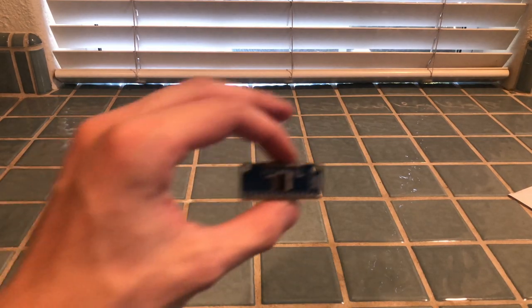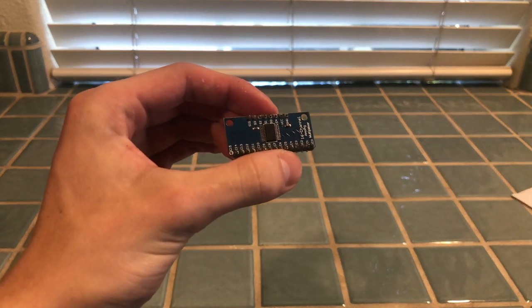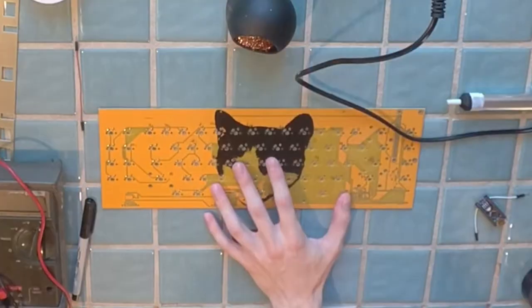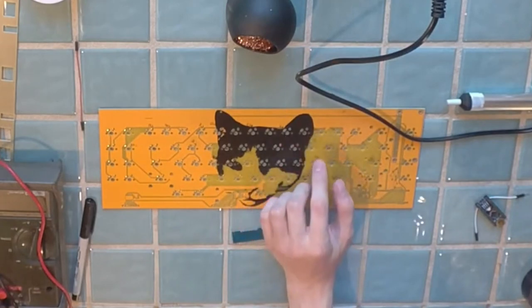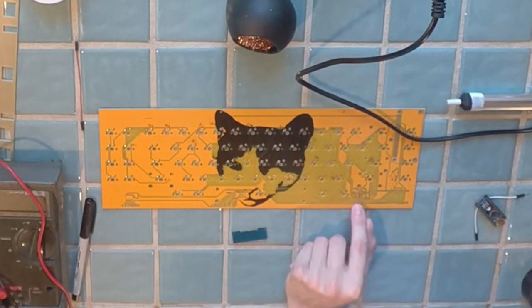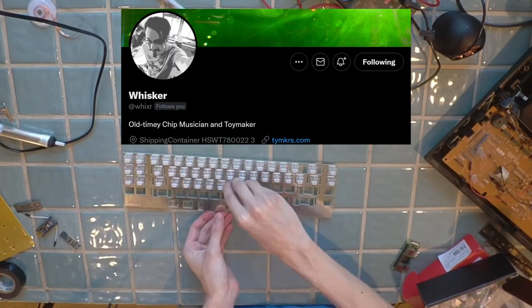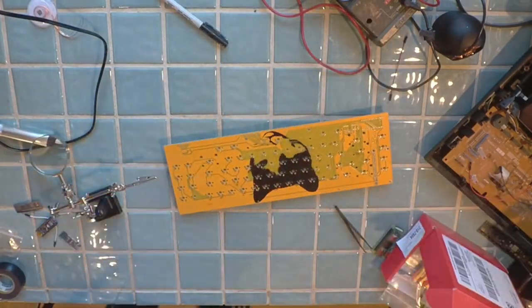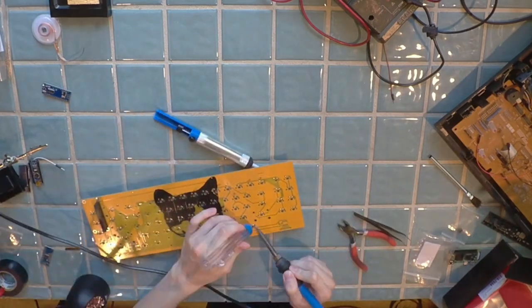Since I didn't think I'd be able to desolder it without breaking it, I decided to start over and wire up the multiplexers from my prototype to a new PCB. I labeled a pin from each of the keyboard matrix's rows and columns so I could solder wires from each of them to the multiplexer's channels to scan the keyboard. One of my viewers, Whisker, sent me these Matthias Alps switches — they're super clicky and should feel great to type on. Thanks for recommending them and sending me a bag of the extras you had.